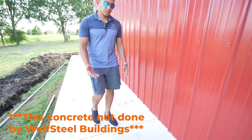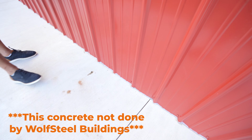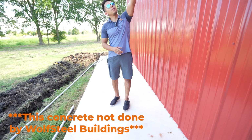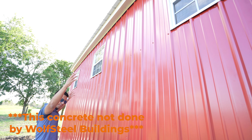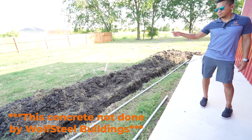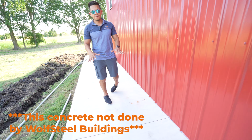We knew this would arise, so what we did was we caulked the building. Now this doesn't really prevent it, and it's not a long-term solution. However, the next solution is that we don't have any gutters, so we're gonna run gutters to minimize all the water that falls here. They have a sprinkler system that's pushing this way, and we're gonna make sure that it faces that way. Okay, so that's how we're minimizing the water that is falling here.